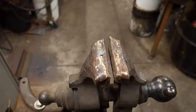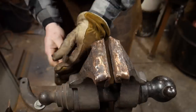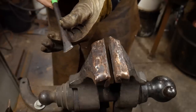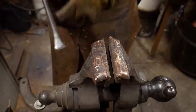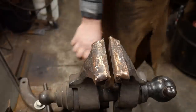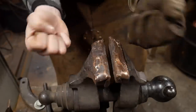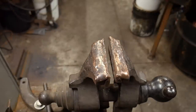I'll grab a slitting chisel. If you don't know what a slitting chisel is, they look like this — they have a curve to them, they're meant to do hot work, and they're fairly narrow in profile. Most slitting chisels or hot cut chisels are cut to a 30-degree angle versus a cold chisel which is 60 degrees. We're going to slip this right in there and pry out. We do need this to be good and hot — if it's too cold, you're going to really fight it.